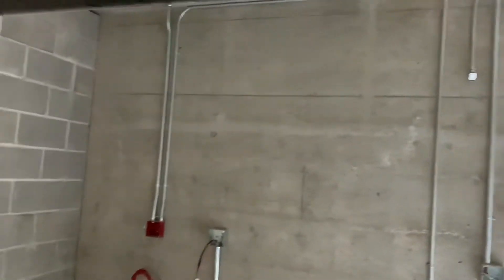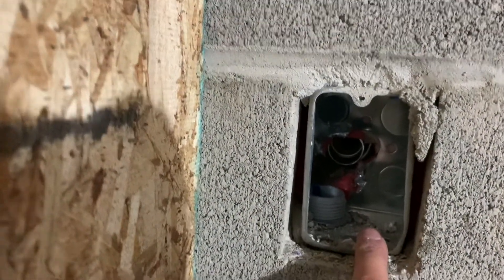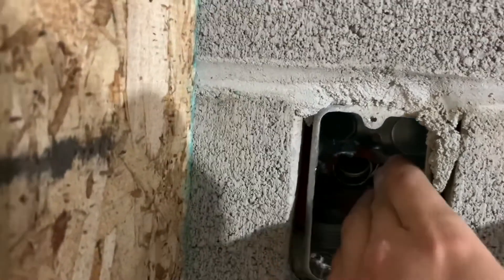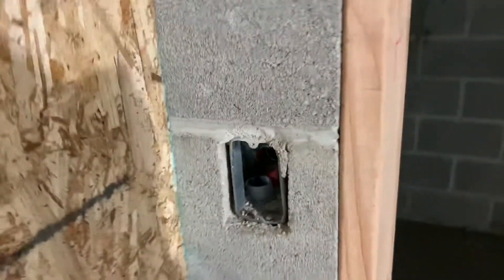So the last part right here — had to drill holes in the back of this box; there wasn't enough room for two connectors back to back so I went with one. This is for low voltage, so I had to drill a hole through the concrete right here and stuck the pulling L — three-quarter — right there. Then went ahead and added a little kick to get it close to the wall, going up with a three-quarter ninety, cut right there to make it easy for the three-point saddle. From there we did one stick all the way, which turned out really nice.